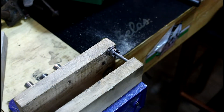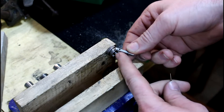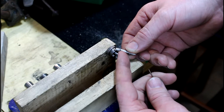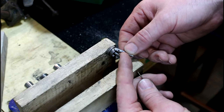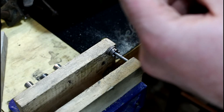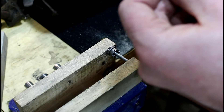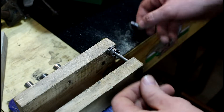I've been thinking about this for a few minutes. I was going to stick this in my little mill and spot drill it with a center drill and get it right in the center. But after looking at this a little bit closer, this thing is drilled — this hole is actually drilled off center from the best that I can tell. It's off to one side a little bit.